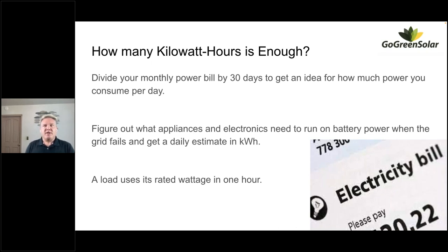There are a couple of ways to quantify your power usage. The easiest is to get your power bill for a month and divide by 30 — that gives you kilowatt hours per day. Use 1,000 kilowatt hours a month divided by 30, and that's your daily usage. Keep in mind that's an average — some days you'll use more than others. That gives you a good solid baseline for knowing how much power is being consumed at your place.